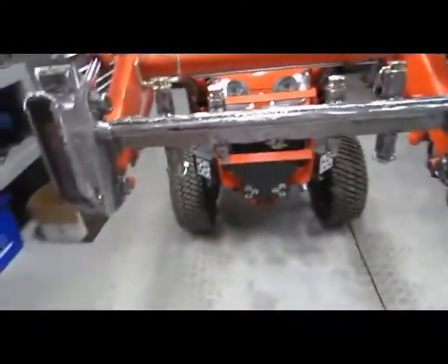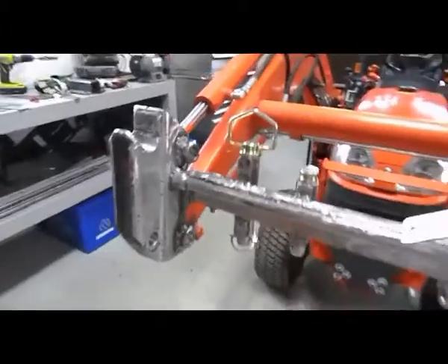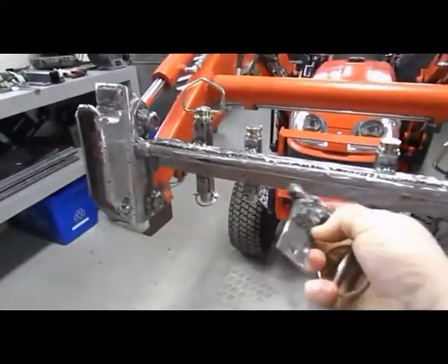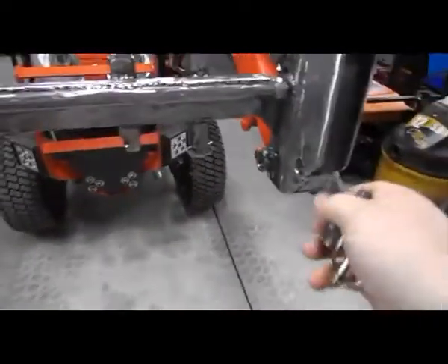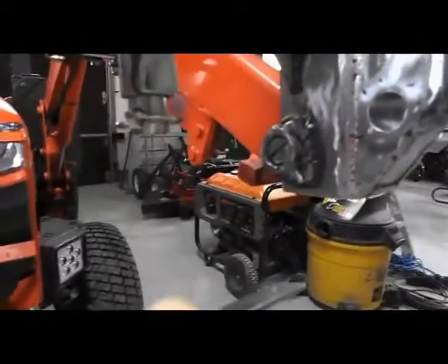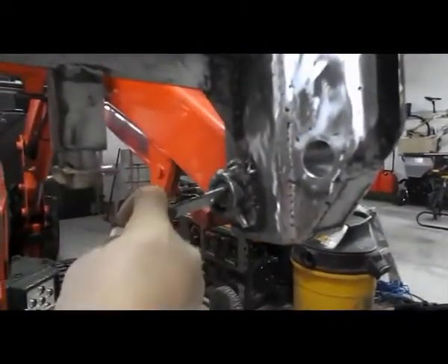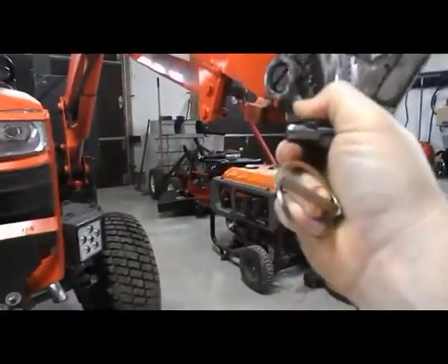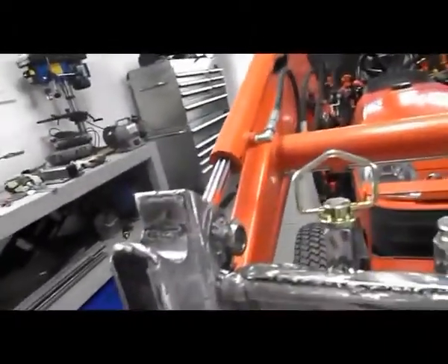There's this little middle piece here — it's a little chuck that I made. I had discussed the fact that when you put the pins in it was hard to turn them once the pin is in, so I made this little chuck that fits into the groove here and I can turn and twist the pin to release the bolt. That way I don't have to bring a screwdriver or a special tool with me.